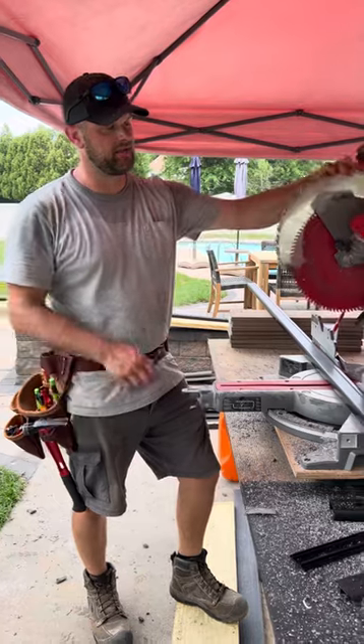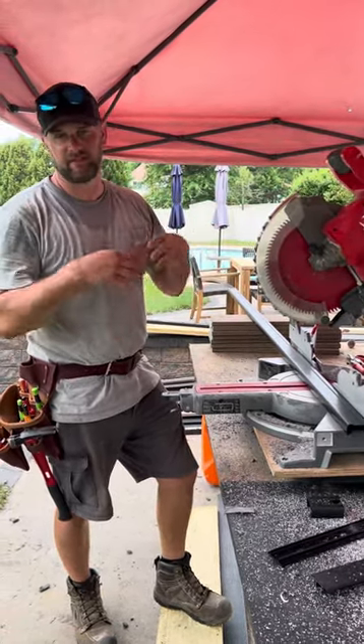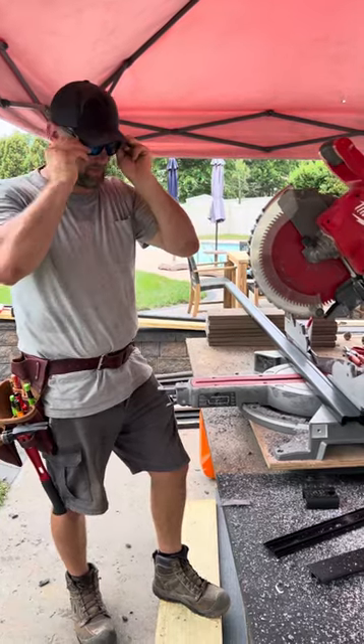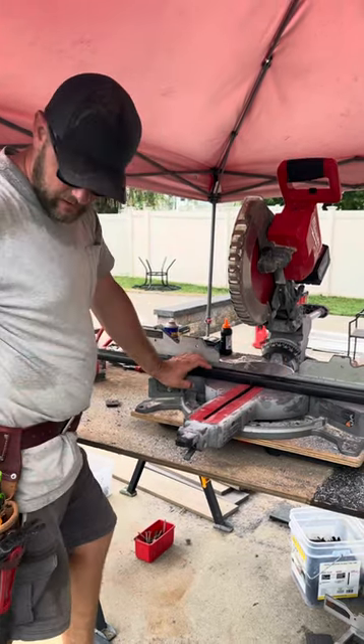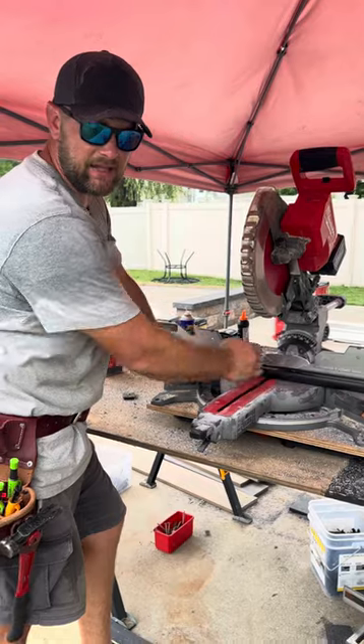Repeat the process for the top. When cutting aluminum, it is imperative that you have a non-ferrous blade on your miter saw. This is very dangerous because shards of metal are going to go everywhere. Definitely make sure you wear your eye protection. You can see that's my line — this is the piece I'm getting rid of, so put an X on that. Make sure you cut on the opposite side of the line that you're keeping.